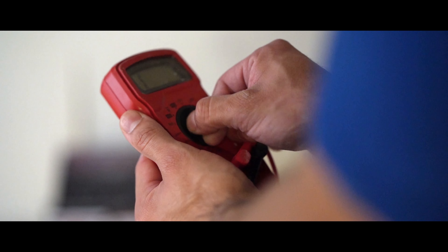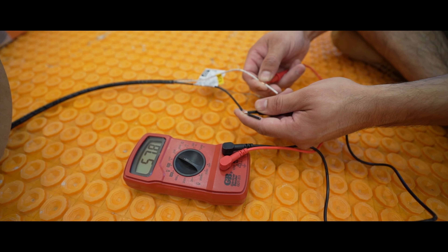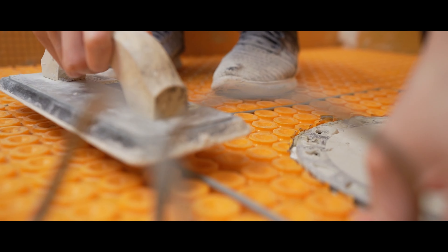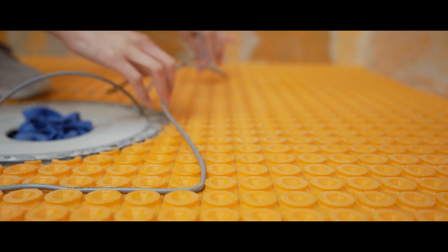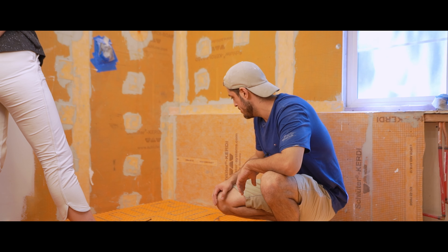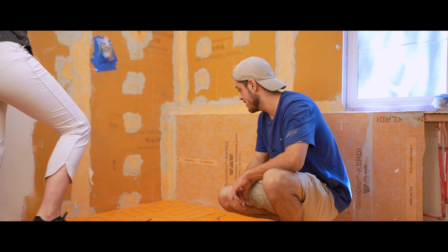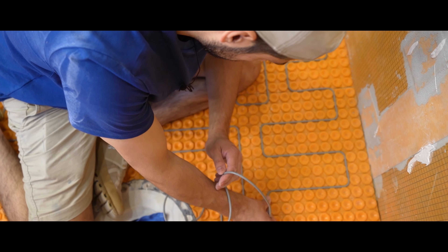Before installing any of this wiring, I need to check for damage by checking Schluter's numbers from the factory. The resistance of the wires is in spec, but we have a couple more things to keep in mind. Next up is the planning stage. The wire needs to be run three inches from all walls, two inches from fixed cabinets, and six inches from floor drains. We can run with 3/2 or 3/3 stud spacing. Let's start at the shower — because we're going to be installing two separate runs, it's good to start at the shower because it's a shorter distance to the thermostat.